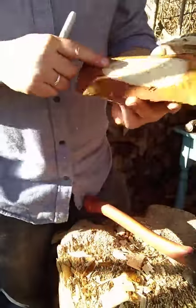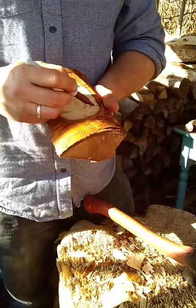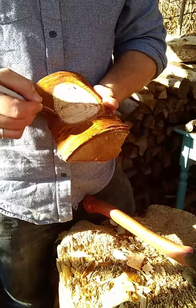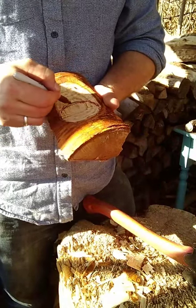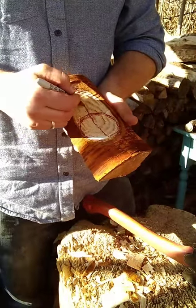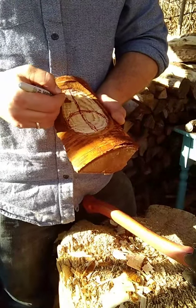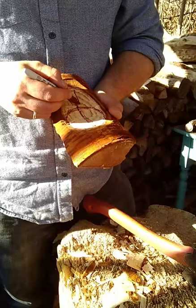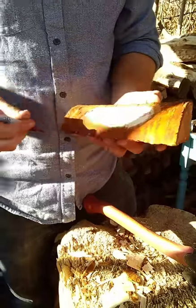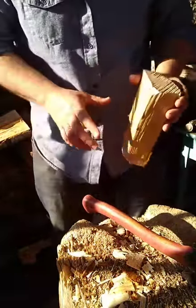The scoop is going to be pushed up so that about two-thirds of it is up on one face, and the other side is the handle. That way the rim of the scoop and the handle are on two different planes — which is what makes it so you can have the scoop resting with the rim level and the handle up in the air, making it real easy to pick up afterwards.